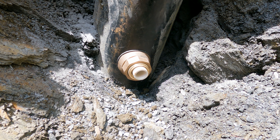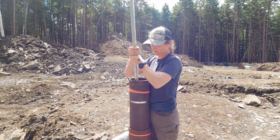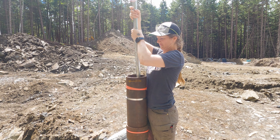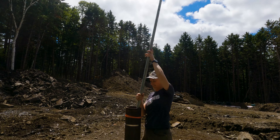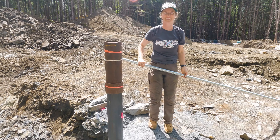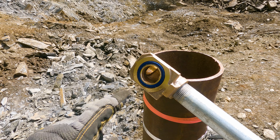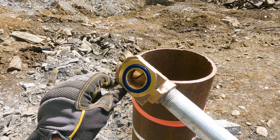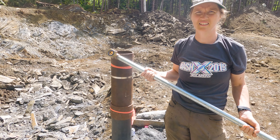It's pretty tight. Now I'm going to pull out this piece of pipe — the PVC placeholder — that'll allow the two sections to separate. All you've got to do now is lift and wiggle. When it gets towards the top it's going to be quite hard to support, so you probably want to lean it over because it's a 10-foot long piece of pipe. The pitless adapter is now installed — this piece slides into the piece we just installed and the drop pipe comes out here, water comes through here into our new supply pipe.